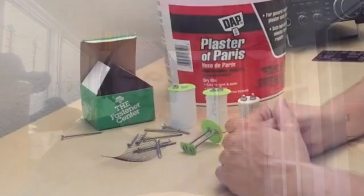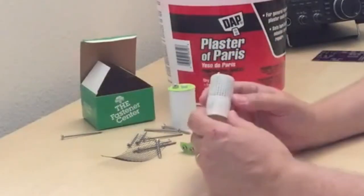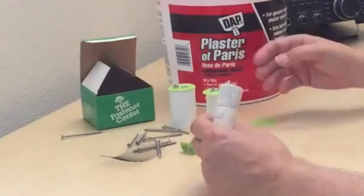The angle here is about reducing water use. If you dump water on the ground you don't know if it's soaking your plant to death. The most innovative part of the project is the water sensor — a couple of electrodes encased in plaster of Paris that you put in a four-foot-deep hole. When that gets wet, the conductivity goes up.